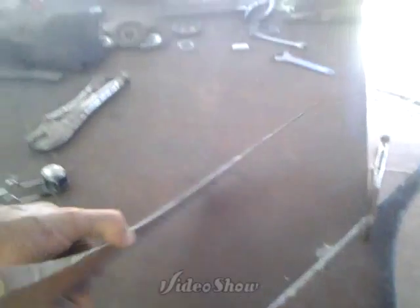Alright, while that cools off I'll get the weld machine and everything out. Then I'll come back and cut it to this shape and clean everything up and get ready to start tacking stuff on. I'm trying to let it cool — this is only 1⅛ inches and I'm trying to frame the front of this end, keeping it from warping as much as possible. It's not hard to bend back, just less trouble.